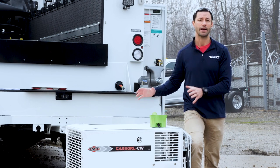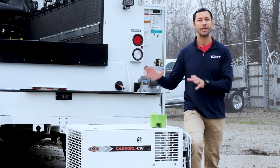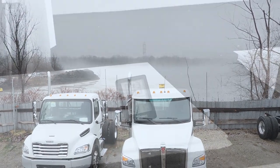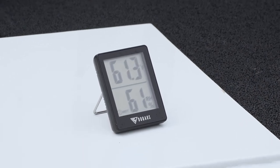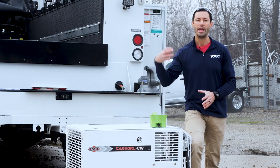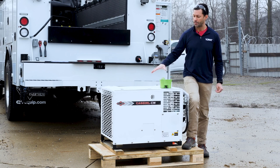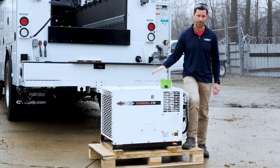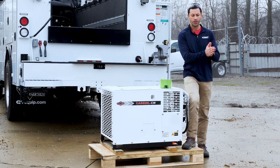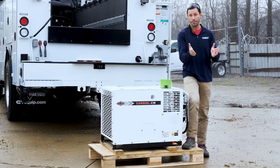The rotary screw is the exact opposite. You want to run this compressor for a long time on a regular basis to get the moisture out. Today's a perfect day to talk about this — when we started this video we were at 70% humidity. When you start this compressor, it's pulling moisture into your system. If it does not get hot enough, that moisture gets trapped in there and causes a lot of problems. The recommendation from the manual is that it's run at least monthly — with your air drain valve closed so it only builds up to 150 psi and comes up to temperature.